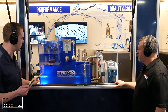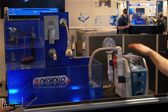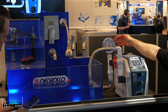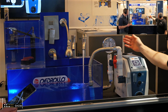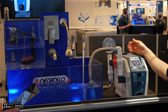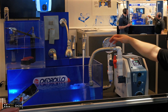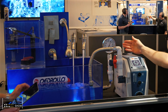This is what you might find in a typical residential application — faucets and a toilet. Right now the pump is in standby mode and has built up to 60 PSI. Let's go ahead and turn on a faucet. You can see the pressure drops temporarily until the motor kicks on — and now it's back up to 60 PSI. The motor is only running as fast as it needs to to maintain that pressure, so right now it's running very slow.